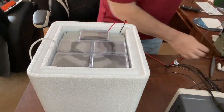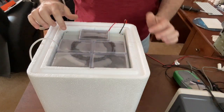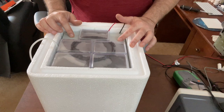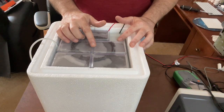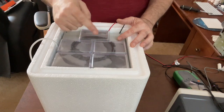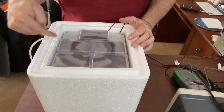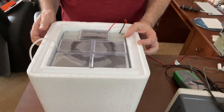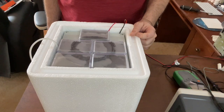I've done some measurements with this handheld meter. At maximum field strength, above this plastic, it's at most 200 gauss. We have maybe 0.8 gauss at the center. There's flux pointing downward in the center and flux pointing inward toward the center, but barely any pointing upward. Over here it's all pointing upward, and over here it's pointing outward all the way around. If you have an outward magnetic flux and you can get an electric current going circumferentially, that would produce a lift upward.